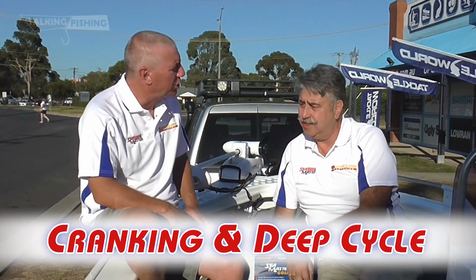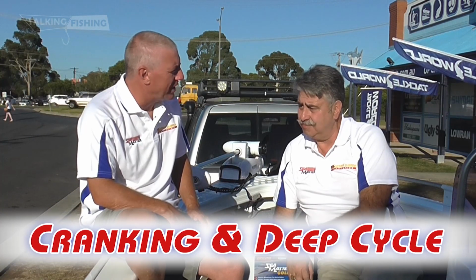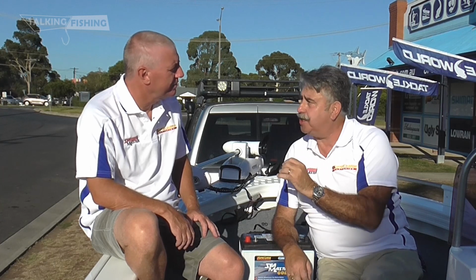Michael, tell me the difference between a cranking battery and a deep cycle battery. Not a problem. David, a cranking battery is one that receives constant charge from an alternator. That can be a car or even a marine battery. They've got a built-in alternator regulator, something that feeds it voltage or charge. A deep cycle battery doesn't need that. You charge it, it's the makeup of the battery, and it's made to discharge and charge constantly hundreds of times. Whereas a normal cranker, once you do it a few times, you will ruin the battery.